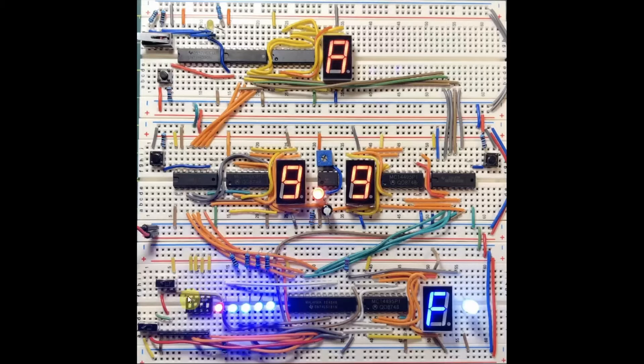The 16 different arithmetic or logic operations are determined by this 4-bit DIP switch, which is interfaced with the IC74LS181. This slide switch here determines the mode of operation, whether we are doing arithmetic or logic operations. And this slide switch here determines whether the carry-in into the 74LS181 is 1 or 0.